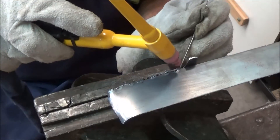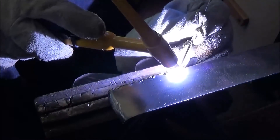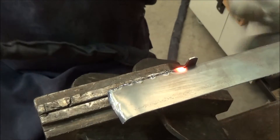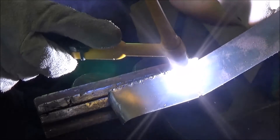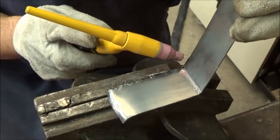I'm tacking the sheet between the letter T at the moment. And I'm putting an extra bit of weld just in the corner, because I want to be able to bend the steel up. So if I just run the torch over it, it bends very easily to move around the shape of the letter.